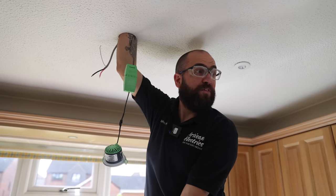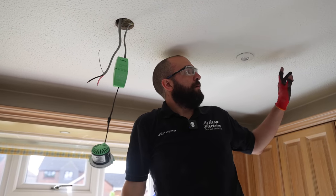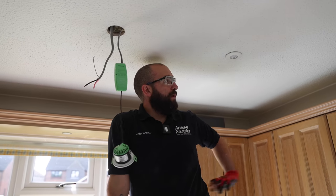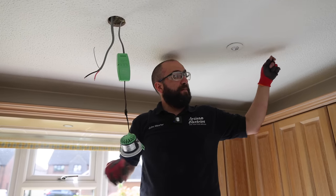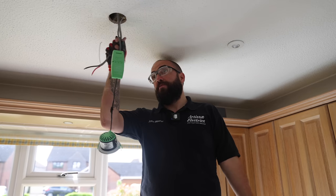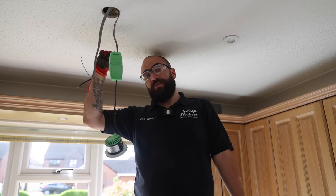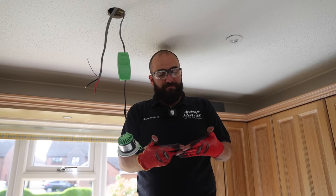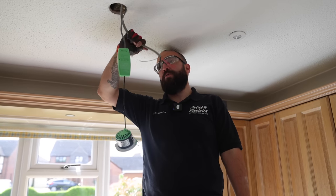You can hear it across the ceiling. I think we'll have to cut a hole in the, oh my God, that's gonna be a nightmare to get down to the board. We'll cut a hole in the bathroom ceiling and look for the cable there, and then we can tie on and pull over to here on this. I can hear it moving. I wonder if we pull it across, a JB is gonna come out on the end of it, and it's been jointed and the earth's not connected. If not, it was just damaged at some point somehow.